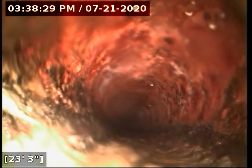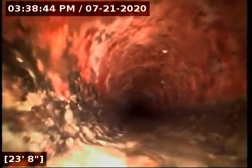Now we're transitioning here to cast iron pipe. And I'm going off of the cleanout diameter right now. This is making a flush transition to cast iron, so my assumption is that we're still in 3-inch diameter pipe. Sometimes guys will run a 3-inch cleanout and tie it into a 4-inch line. There's just no way to tell in this circumstance because of the way the cleanout is arranged.